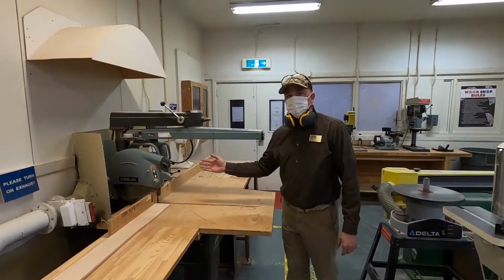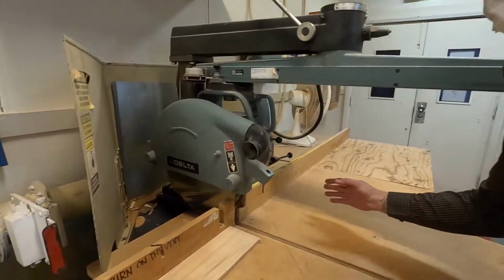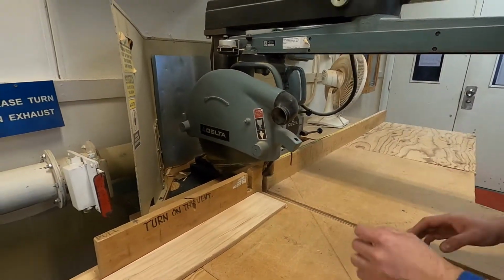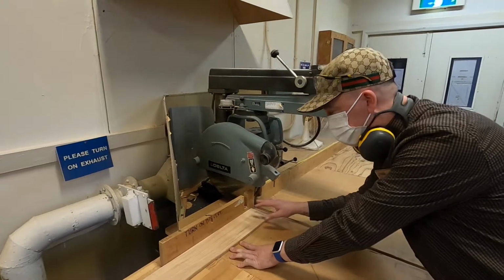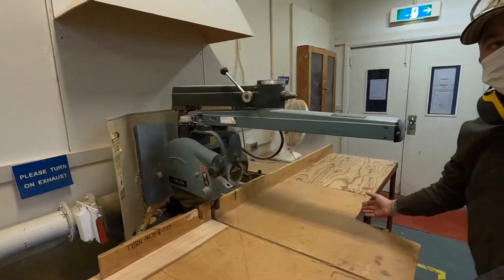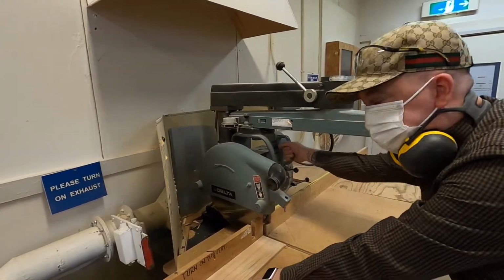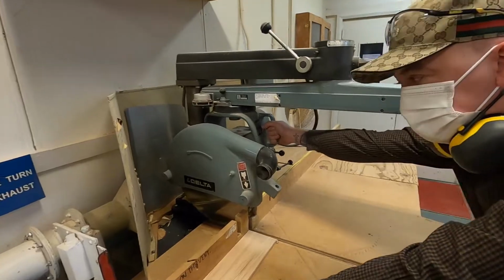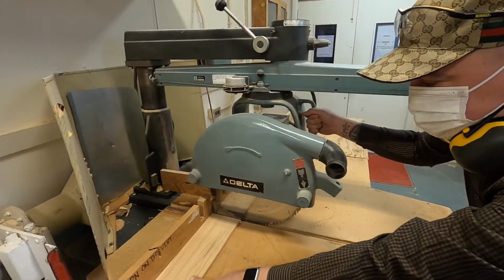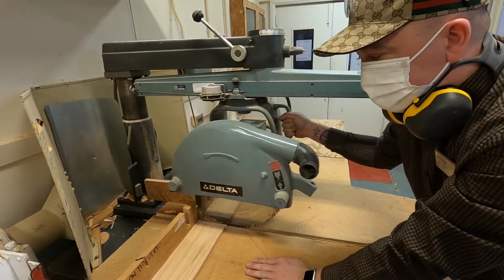Next up, we have the Radial Arm Saw. It's made for making that first initial rough cut on large pieces of lumber. You get your piece of wood set up here, put it where you need to be cut. You're going to turn the machine on. You're going to pull with your arm closest to the blade, depending on whether you're right or left-handed. And then you're going to pull through, and you only need to go through past your piece of wood, and then go back.